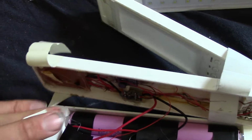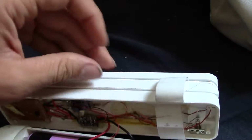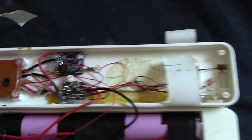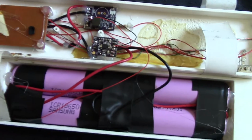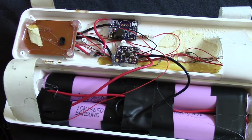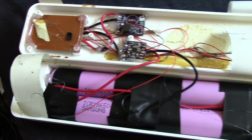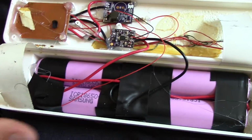So that's not ideal. The other thing, lastly, that I added was a step-up regulator, a DC to DC converter, so that it would stay at a consistent voltage so that the brightness doesn't dim based on the battery's voltage dropping, because it is connected directly to the LED when it's powered on through an N-channel MOSFET. So yeah, by keeping the voltage constant, the current will obviously change as the battery runs out of juice, but it won't dim the light. And so I really wanted that.